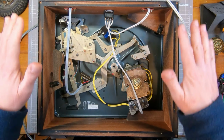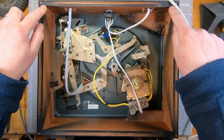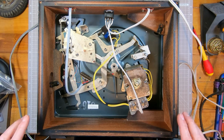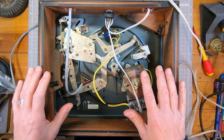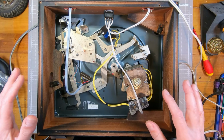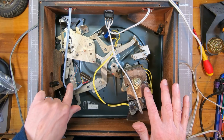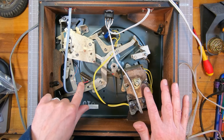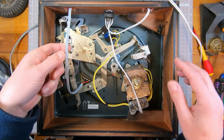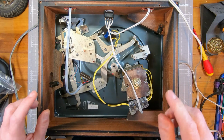Okay, so this is the inside of the turntable underneath. It's upside down, and I've removed the bottom plate, which is just hardboard. So you can see it's very clean inside. Here's the motor. This is the wiring from the tone arm, and then that's going out to the amp, and this is the mains cable. It's only 2-core mains cable, so there's no earth.